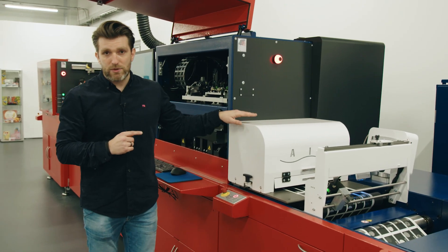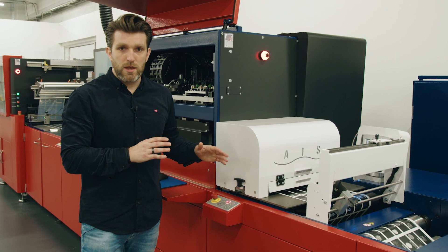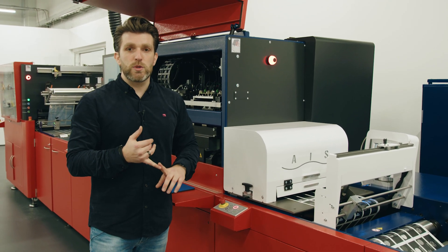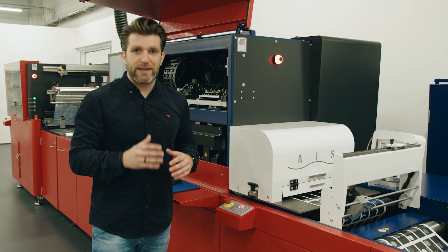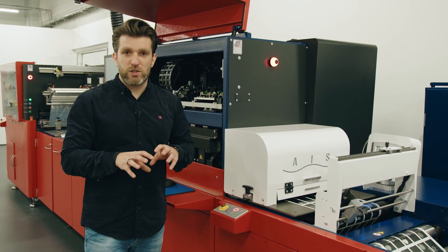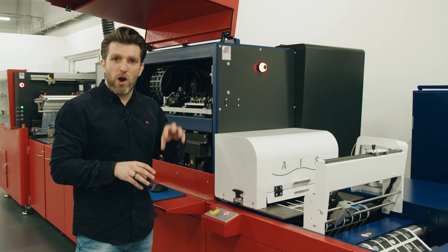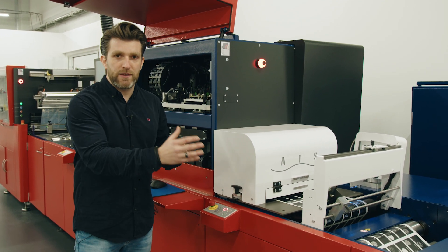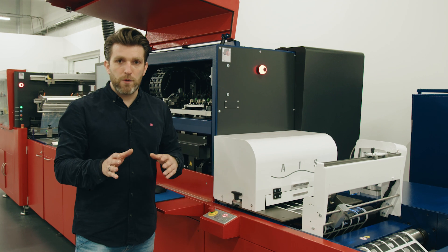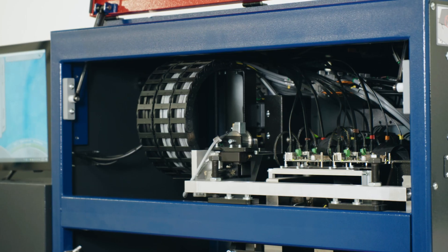This brings us to the brain of the machine: the camera system. These are three cameras constantly monitoring and inspecting the printed web — not only on shifts left to right and up and down, but also on skew, stretch, and whatever types of distortions that can happen with all the different printing technologies. If it sees that some image is distorted, it sends it to the software and the actual printed varnish is adjusted to the actual pre-printed image on the web. The camera system will inspect every individual label, assuring correct and high-quality registration.